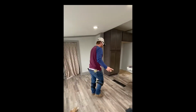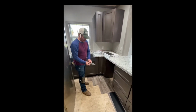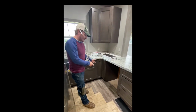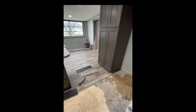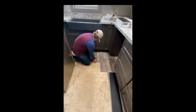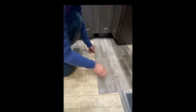Now when laying flooring, I like to cut mine in sections like this. Think of a 45 on your speed square, you see? But don't cut them all the same. Don't go out there and cut them all 45 or 32 and split them, make them different. Then you can always use the scrap piece on the other end. So it minimizes waste as well. For example, I like to put my floor in this way, which is what I was trying to tell you earlier.